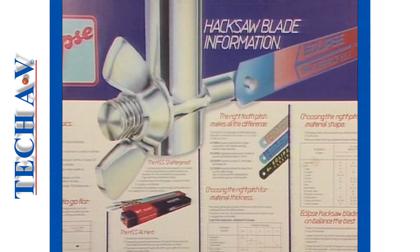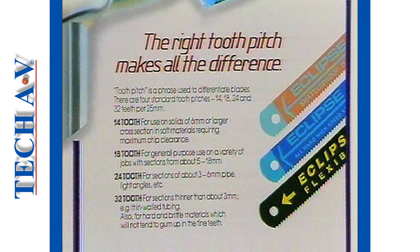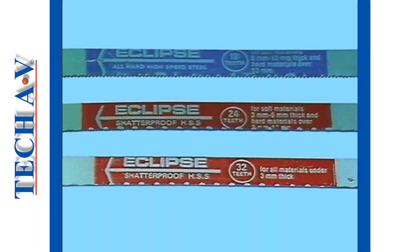This quality will be marked on the blade. More scientific selections must be made when cutting some modern materials, such as stainless steel. Always consult your supplier's advice for selecting blades if you are in any doubt. It is suggested that you now study your hacksaw blades and see how to make your selection for different types and thicknesses of materials, after which you will learn how to cut material.